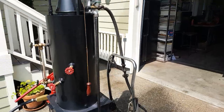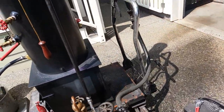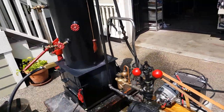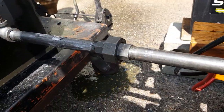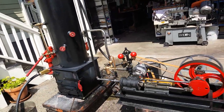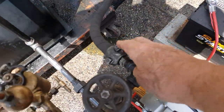I got the steam hose on there. It's so close, I would just hard pipe it in. The steam hose for this is about $100 and I don't think it's worth it, because you're going to have it in one position. You can just put a union on it like this — that little union right there, half inch — and that's all you need to disconnect it. You just do it on your incoming pipe over here, right here.